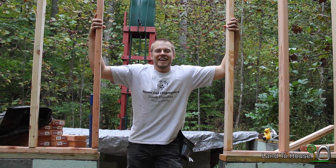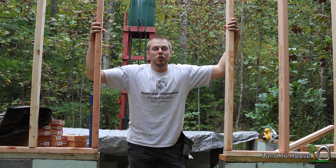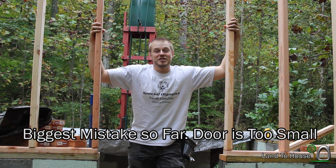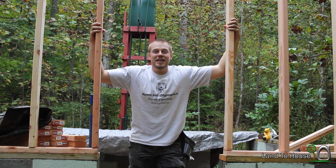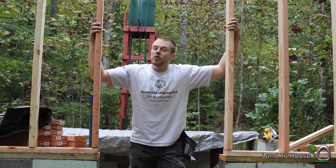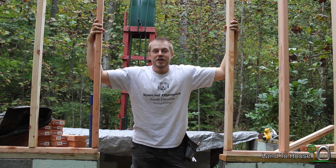Hello, I'm Seth Johnson with Land the House. So in today's Tiny House video, we're going to be framing up the front door. This is a 32 inch opening, which is smaller than most front door openings, and I found that out a little bit too late. But it is possible to get a 28 inch door, and that's what we're going to do. After the door is framed, I also want to put a window above the door to allow ventilation upstairs. So let's get started building this frame.